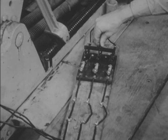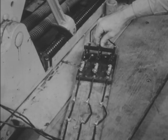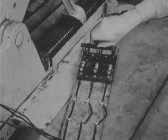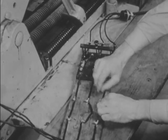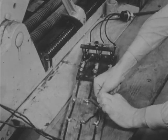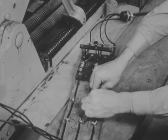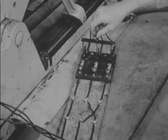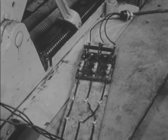Then connect the service and motor wires straight across the board. Close the switch and the motor turns the screw — note the direction. Open the switch again and reverse the connections of any two wires.